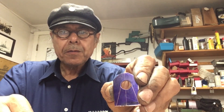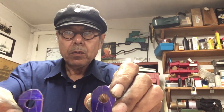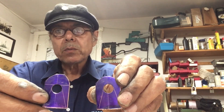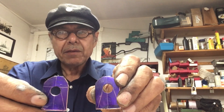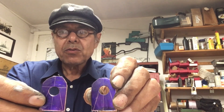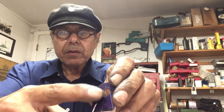Sometimes I forget how many tools I have, and I realized that I had a nice Pexto hole punch, and I was able to make a nice accurate hole without having to use a drill, which would have just chewed up the copper something fierce — I had a feeling it would grab out of my hand or out of the vise and chew these things up and I'd have to start all over. But that hole punch made it very easy. Now all I have to do is get my shear in there and knock out that center section for the saddle.